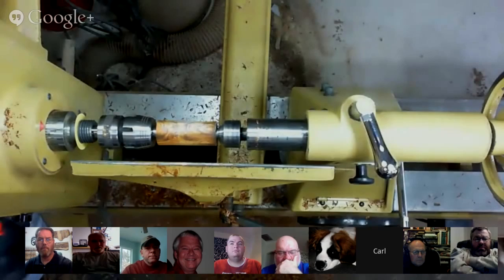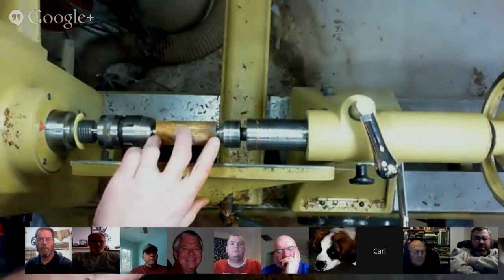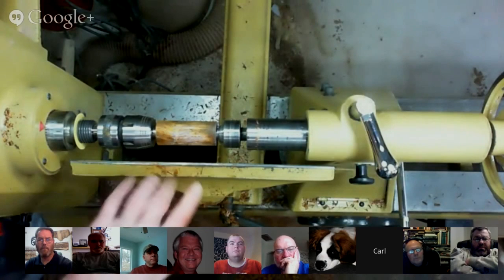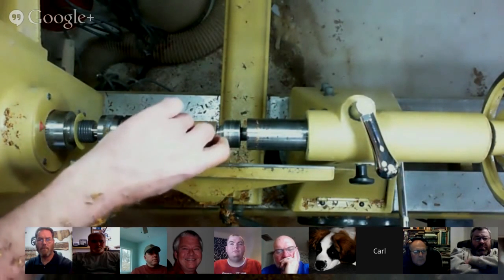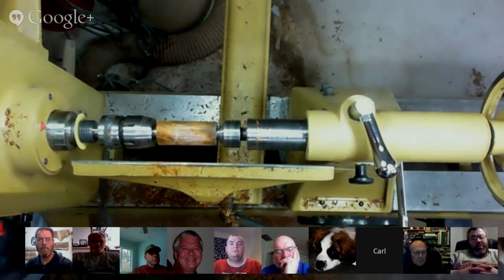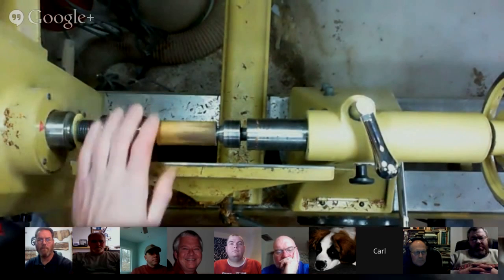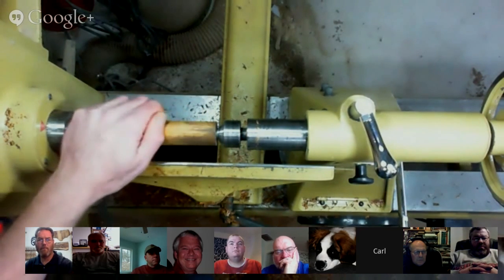All right, and the other thing I forgot to mention was I normally make them about 2 3/4 inches long. So I start out with a 3-inch piece, and then as I'm rounding it over and cleaning up the ends, my finish length is about 2 3/4. All right. So they're pretty quick. They probably take, if you're not filming and everything else, about a 15-20 minute project.